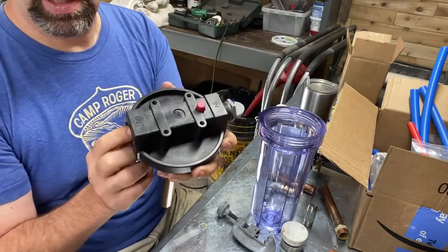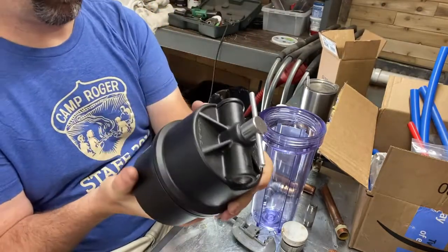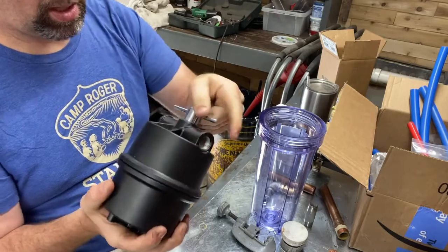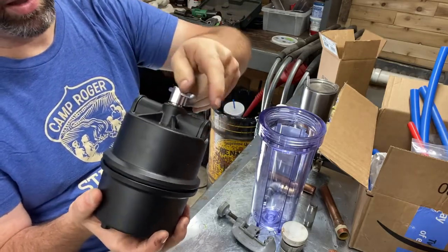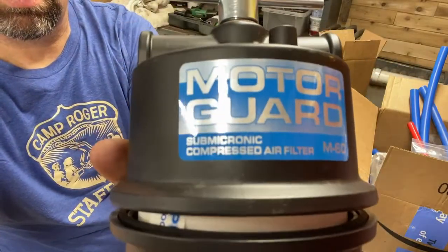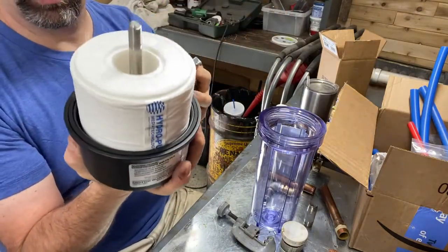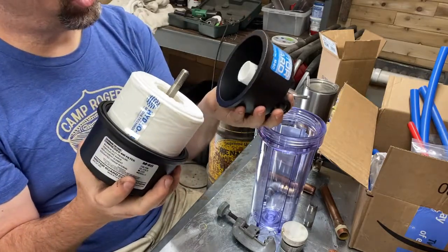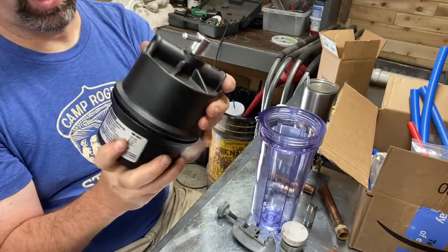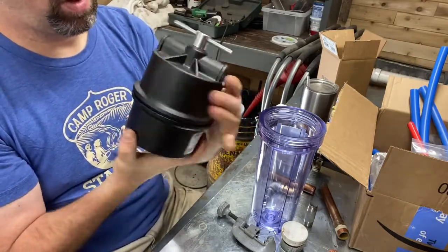Next I'm going to work on plumbing this together with my motor guard filter. I purchased, again off Amazon, a motor guard air filter — part number M60, rated for 125 PSI. It has a nice cast aluminum housing. Inside the motor guard housing is a paper filter which looks remarkably like a toilet paper roll — I've heard you can actually buy a toilet paper roll and stick it in there. My plan is to plumb this filter to the dryer.